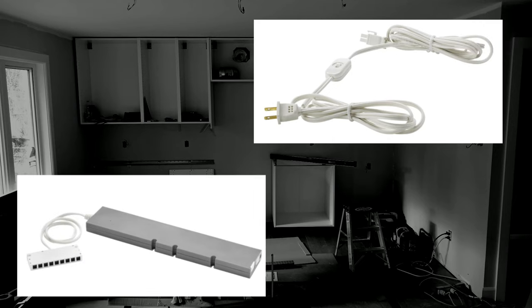So what seems to be the problem? When you look at the power supply and the power cable that hooks up with it, you can see that the cable has a plug at the end, and that means it has to be plugged into a receptacle. You cannot by code just cut off that plug and hardwire it — the cable is not approved for that. And putting a receptacle inside a cabinet is not to code either, unless it's for a microwave hood and a few other appliances that are secured into that cabinet.